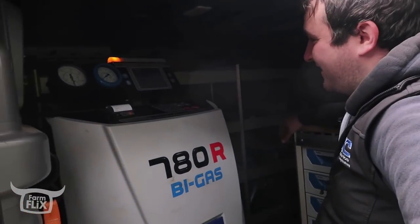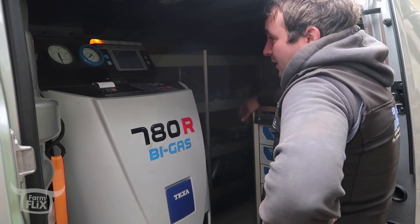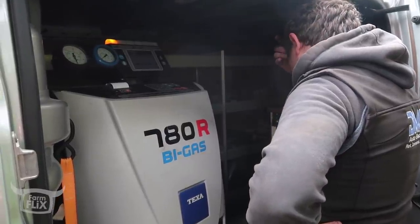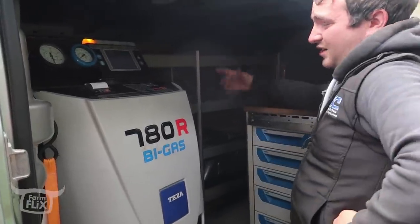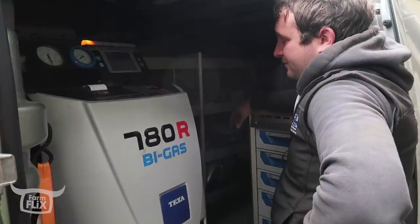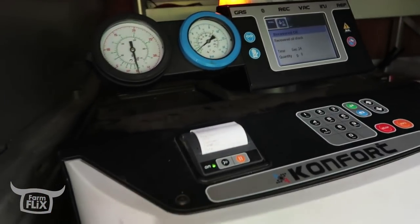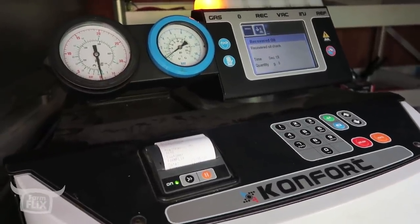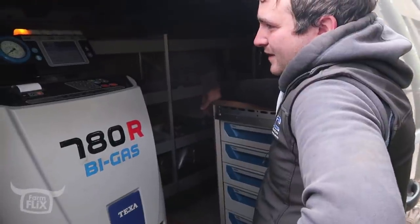How are we doing? We're doing it clean. Every four or five machines - well, depends. If there's a machine with a lot of moisture in the system, she'll do a clean before she'll do the next machine, just to make sure everything's out. So was that just like flushing gas through the system? Just clean herself out before she'll touch our machine, in case there is moisture in the lines or the system, or any bad substances. Nothing exciting in these gauges - nothing much at the minute, only really telling you what's in each of your lines in your aircon system, your high pressure line and your low pressure.